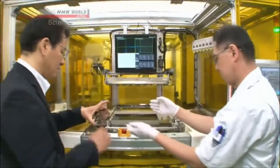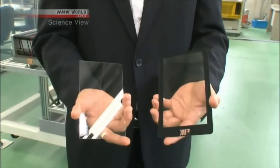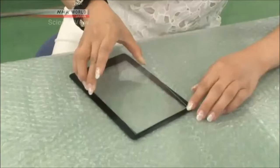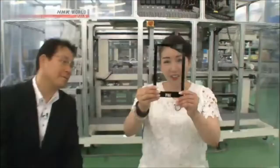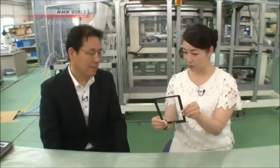The Takumi developed a new technique for bonding the touch panel substrate to the cover glass. Let's see how it's done. The touch panel substrate and the cover glass are both made of glass, so we'll use these two sheets of glass to demonstrate. Try to stick these two together as closely as possible by hand. One sheet has glue on it. When I put the two sheets together by hand — oh no! Look what happened. There are air bubbles everywhere. A touch panel conducts electricity, so it won't respond well if there is air in between. It also looks bad, so it's no good as a product.